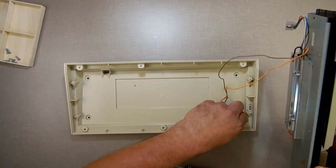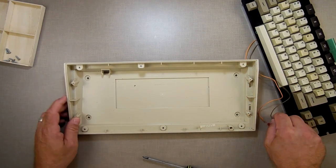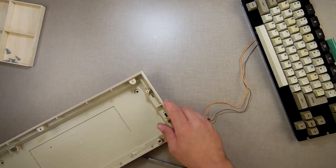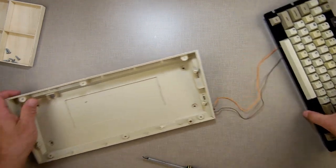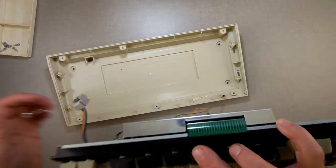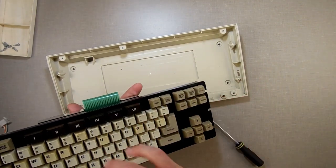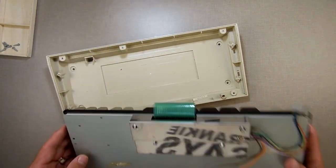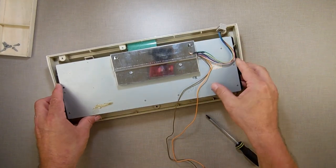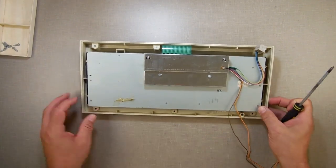And at that point, device 15, which is a keyboard, if it has a key that's been pressed. What it's doing, let's not oversimplify that too much. The keyboard, this right here, the microprocessor in here, is continuously scanning the keys and storing up to 14 key presses in its built-in memory. I don't think it's memory as much as it may be storing it in its registers, but it could be memory, I could be wrong there.